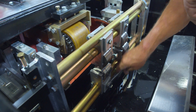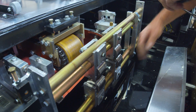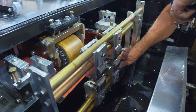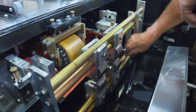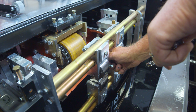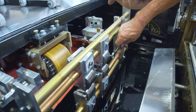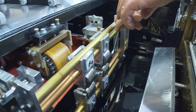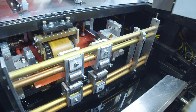When you measure your width, you can take whatever width you're running — 16 or 18 — and divide it by three. You can put some marks on the panel and then go ahead and set up that way. Let's tighten this one up. We're going to move the bottom over to where it lines up on the sides. I'm going to loosen this and set my pressure. By turning this you can see the eccentric cam turns on that. We can loosen that and bring it around to where it's almost touching — normally about a 40-thousandths gap. Then we'll run the panel through and adjust it a little bit further.